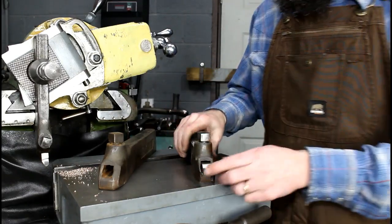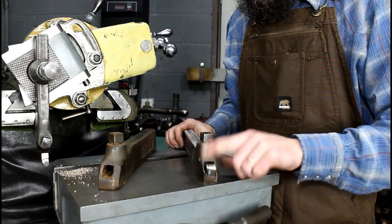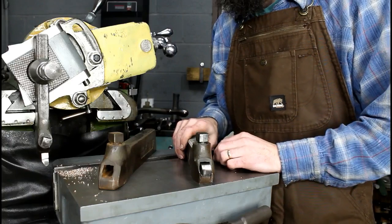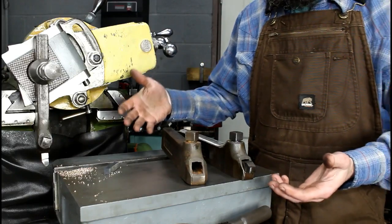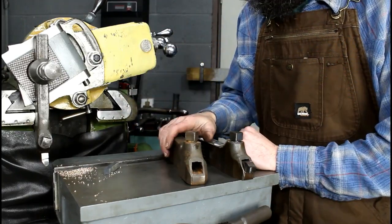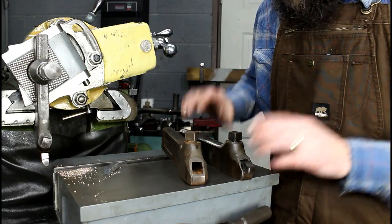I need to get some half-inch tool steel. Now I can use these in the shaper — at least this one for my five-eighths tooling. I don't like to use these extension holders any more than I have to, but they're great when you need the extra length and to maintain a rigid setup. They're designed for this purpose so they're really rigid. I'm glad I did that.